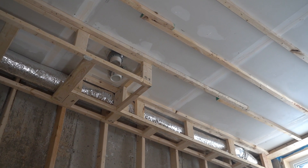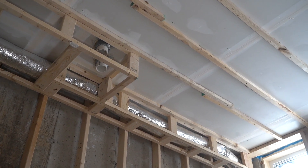First is proper continuation of fire-rated drywall. Often the space is framed entirely before drywall installs, so this creates a bit of a challenge. At the same time, it's a pain to do a complete fire separation before framing the space. So what do you do?